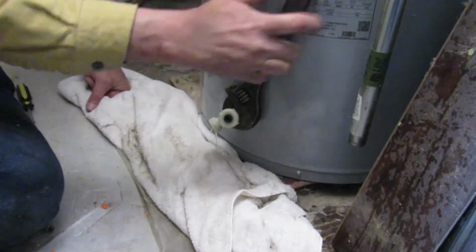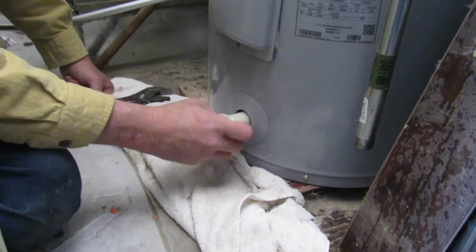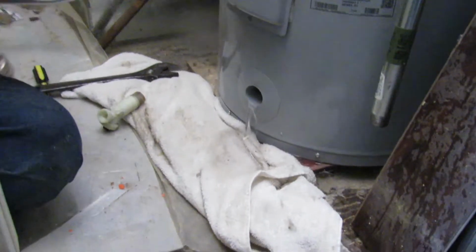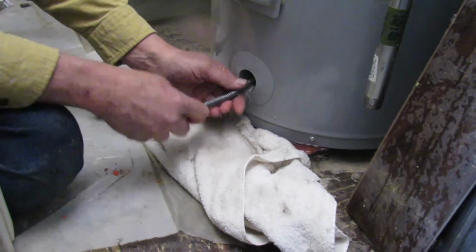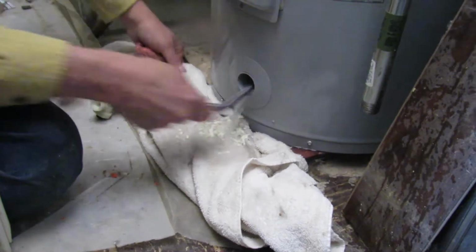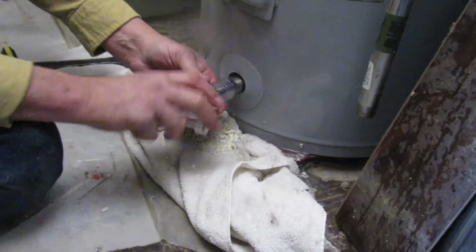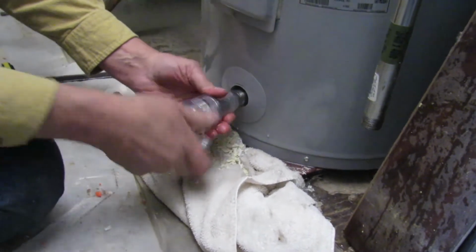If there is an excessive amount of sediment, you may have to wiggle and turn the agitator to make it fit. Be careful that it doesn't get bound up. Screw the turbo tank cleaner loosely to your water heater. Refill the tank completely. This step is very important.